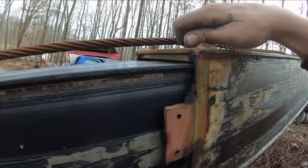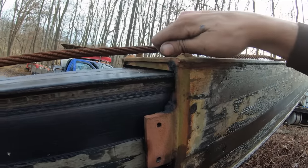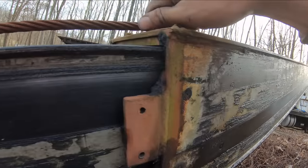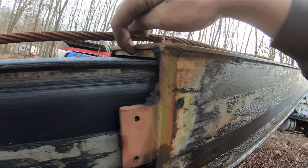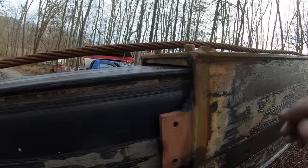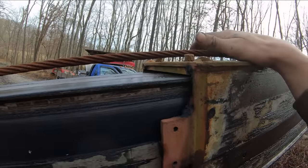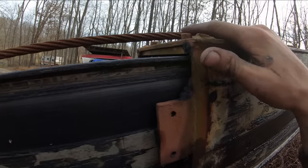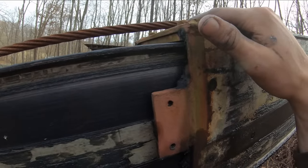Oh, look there, I just found another problem. Not very tight in there. I'll crank that down. But anyway, these spacers, there should only be so much space between the inner tube and the outer tube, and the spacers are supposed to take that out and keep them snug, and they've probably got some wear in them. And that's pretty simple to fix.